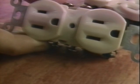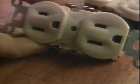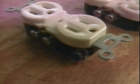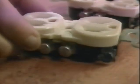This marking indicates what kind of wire can be used with this device. Here are the voltage and amperage ratings. This device is approved for up to 15 amps and 125 volts. There are 4 screw terminals on the body of the switch and 1 on the yoke of the switch. These 2 are brass colored and are used to make the hot connection, and these 2 are silver colored and are used to make the neutral connection. This is used to make the connection to the ground.